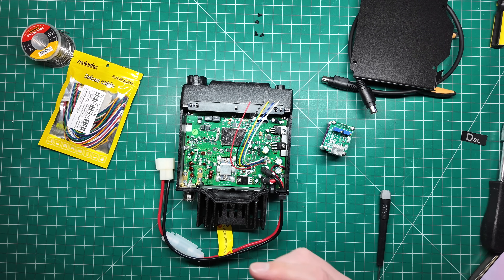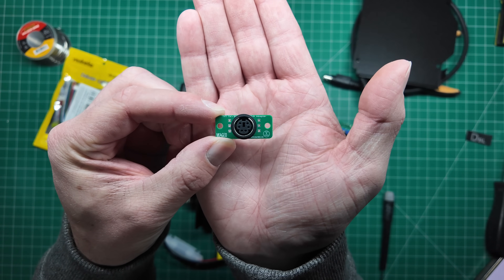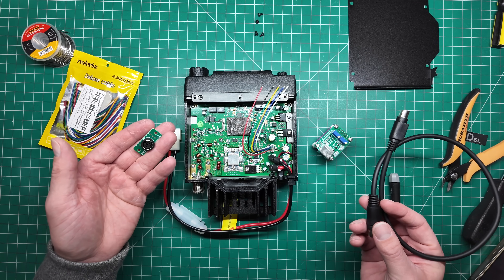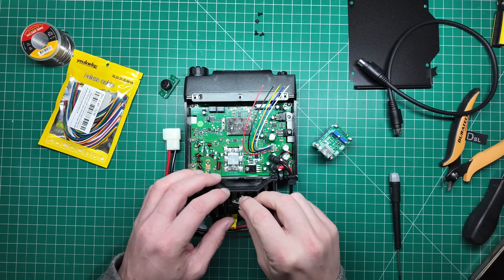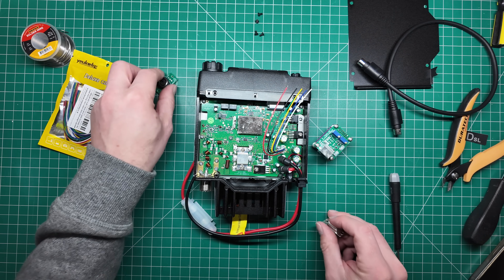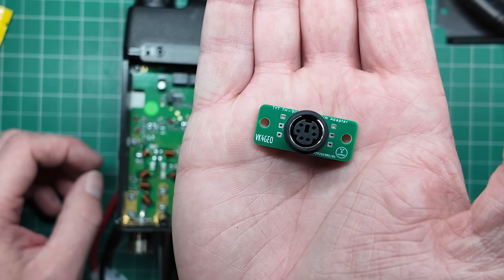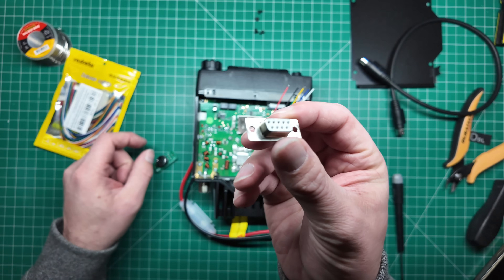A friend and channel member Darren, VK4GEO, has made these little TYT TH9000 mini DIN adapters. We just need to solder our wires in, and then I can use a simple straight-through cable from this to the TOADS DI — it's a really simple process. You could also use a DB9 connector, which fits quite nicely in the back slot. I'm going to use Darren's board; if you want some, he has them available for VK viewers — just look up VK4GEO on qrz.com and he should be able to help you out.